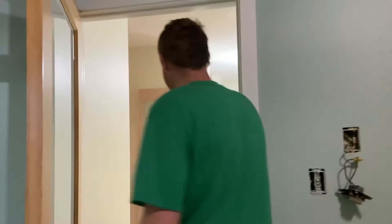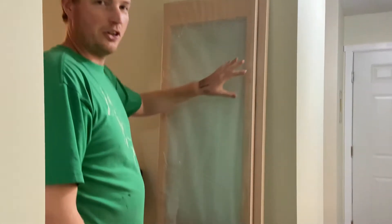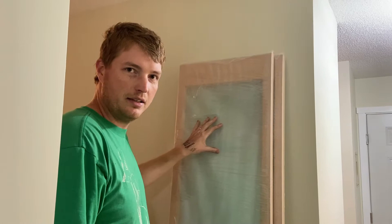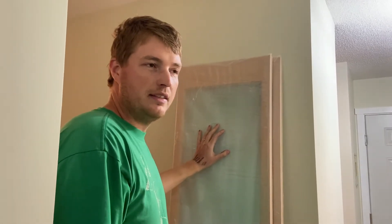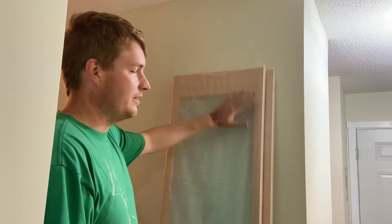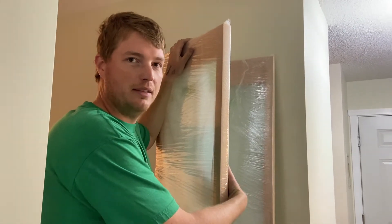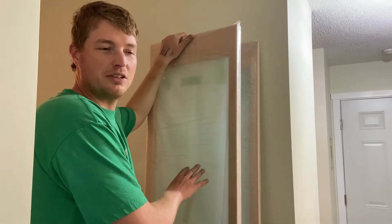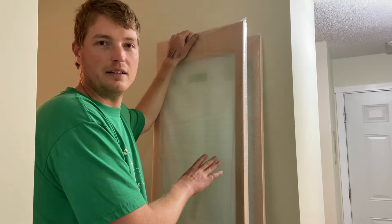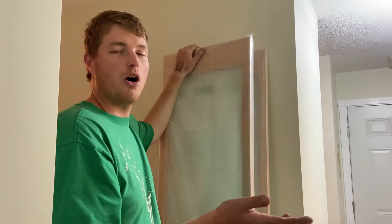The first thing we're going to do is unpack our doors. These bifold doors were made by Fenster Windows — they're solid Douglas fir and factory-finished with a clear coat. They come wrapped in styrofoam and saran wrap for protection. Because one side of a bifold door is always into the closet or folding together, the manufacturing grading is called 'one side good' — one side needs to look good, the other can have minor defects. We'll place the good side down and install the hardware on the back side.